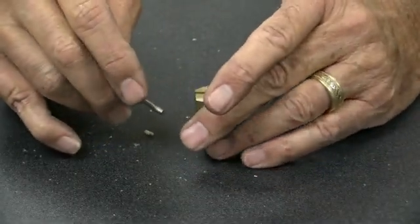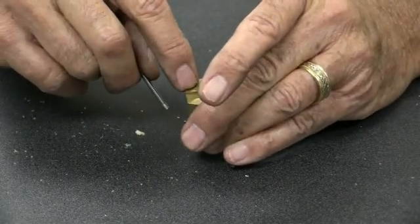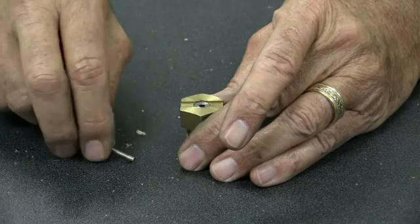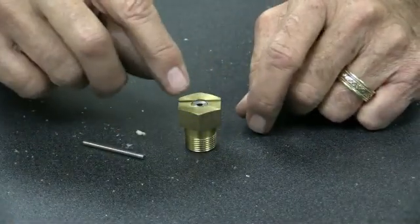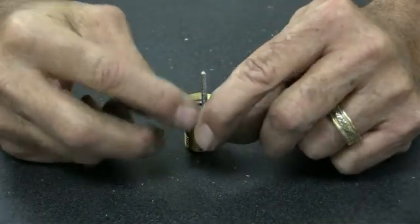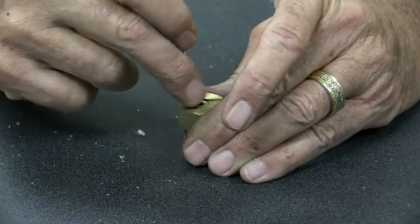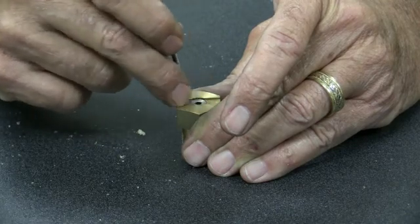Like I said, this is our pin bearing, and this is the one that changed. We made this change roughly 8.5 years ago, and now we have this metal insert inside the pin bearing. The old style pin bearings were all brass. They didn't have the metal insert in. Because our metering pin is serrated, as the valve opens and closes, it goes up and down. So we were wearing out the inside of the pin bearing, and by doing that, it would get egg-shaped.